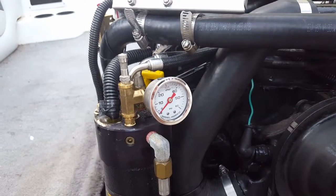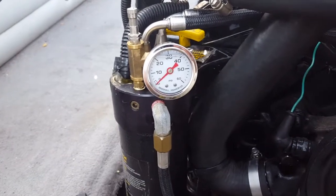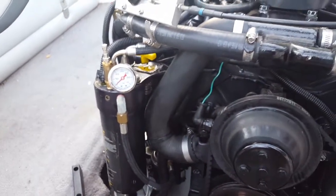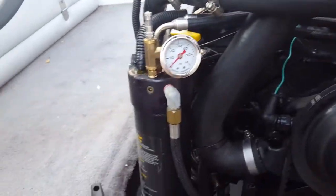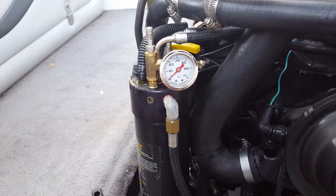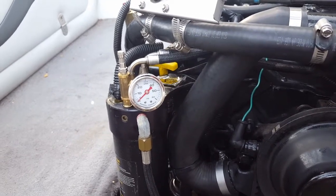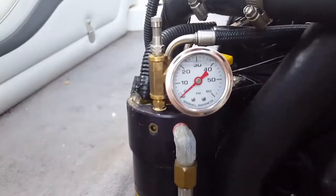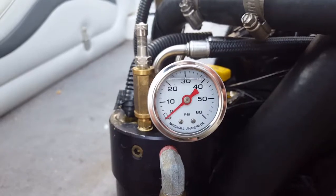The fuel pump — it's got two fuel pumps on it. There's one right down here at the bottom and then there's this one right up here at the top. This is a 30 PSI system. I was having problems with the fuel — last summer this thing wouldn't start. One of the first stage fuel pumps was working and could kick on, but the second stage pump wouldn't, which meant that it wouldn't run. So I got this liquid-filled fuel pressure gauge.